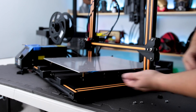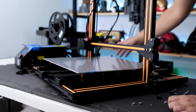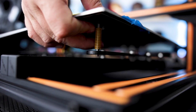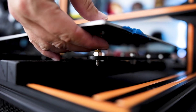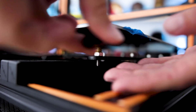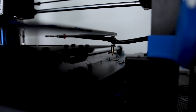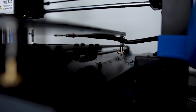First thing I'm gonna do is remove the bed to get full access to the screws and retighten everything. I know the front left and back right corners were giving me the most difficulty. You just lift this up with the spring, slide that bolt in right back through the hole, and now the spring sits on top of the actual bolt. Then you go back through the process of reattaching the wheel to that post. On the Anycubic i3 Mega I was having the same issue on both back bed springs, so I added two smaller bolts there and now it levels beautifully — they have not fallen off since.